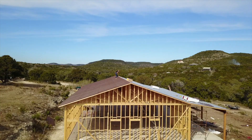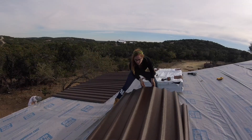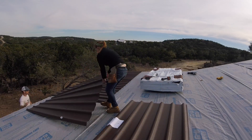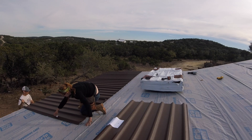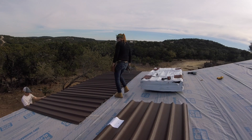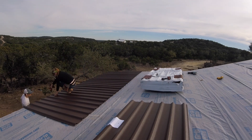This is my third roof to install and besides framing, it is definitely my favorite step. It is hard work but I just love being able to see the dramatic change that it creates. The next day Cody was free to help me out so he relieved my mom. Starting on the eave, Cody would insert a foam closure strip as I laid down a panel. Once the overhang on both sides was established, I would secure it with the first row of screws then grab the next panel.